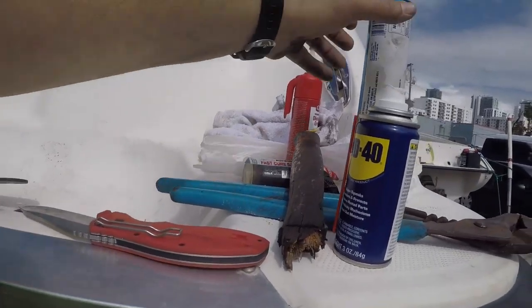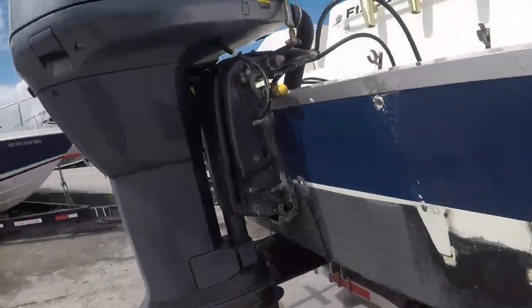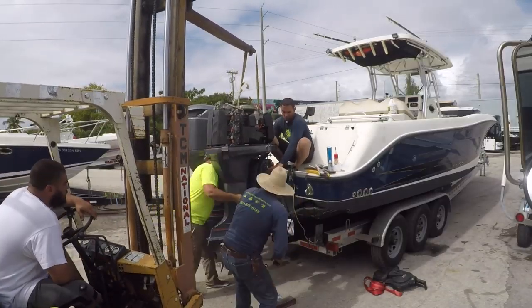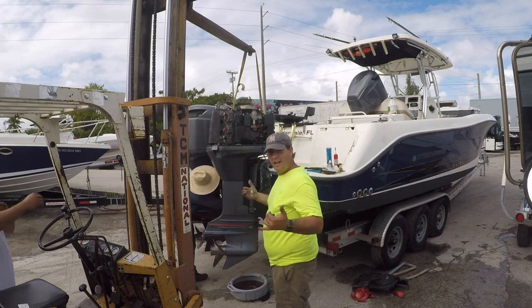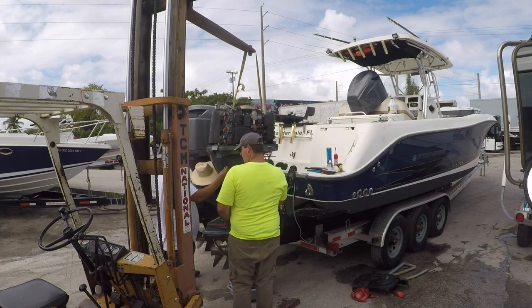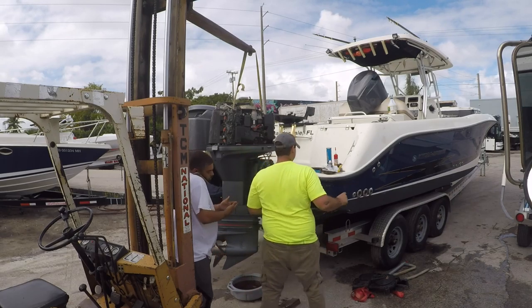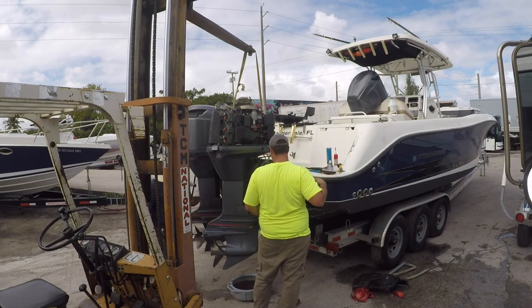While I was busy disconnecting the old outboard from the forklift and putting the new one on the harness, Alex was doing great work — he doesn't know I'm recording! We're hooking up the other engine and cleaning out everything — all the old silicone. I'm going to clean these out and reapply new silicone using Fast Cure 5200 Marine Adhesive Sealant. We also have some new grease and WD-40. Then we're loading up the new engine on the back — let's see what's going to happen.